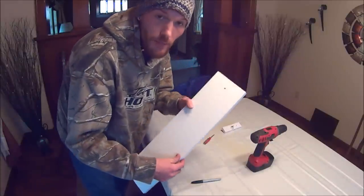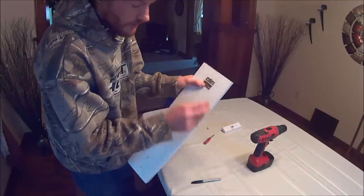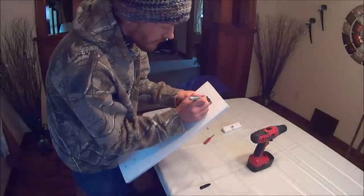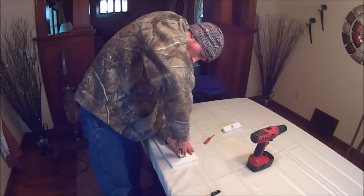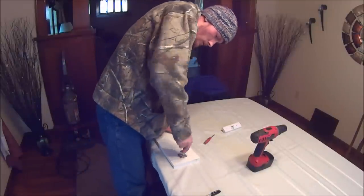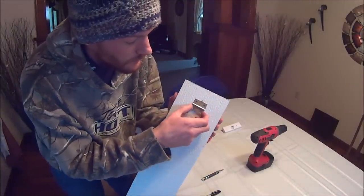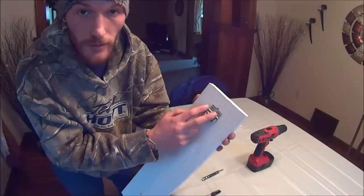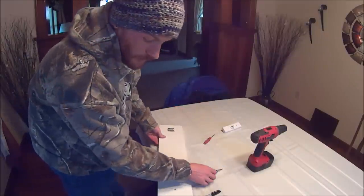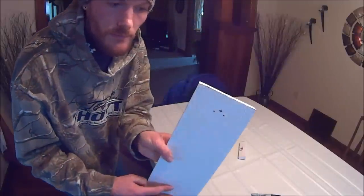Then you take the front of the board and your 1 and a half inch hinge. Once you center the hinge — I just eyeball it — make a mark and screw the front two holes of the hinge down. This is what you're left with: the front two holes centered so the bottom side of the hinge can flip up. Now that you've got it screwed down, take it back out — now you've got your holes where the hinge is going to go. Take your hinge off and your holes are marked.